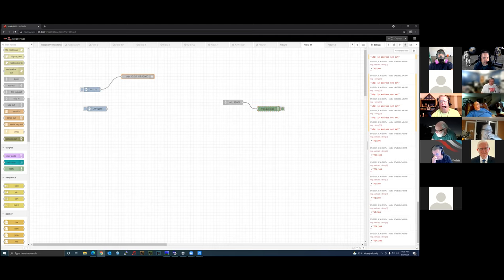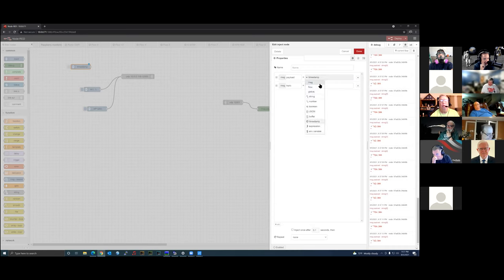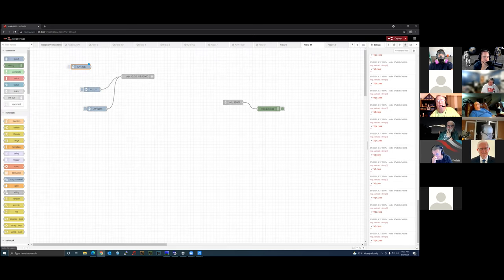PST Rotator, with the newer version, has a cool feature called target and azimuth. Target is your desired direction of the rotor and azimuth is the actual direction. But as you see, what's coming back is AZ colon 304 or 303. What we want to display, we don't want the AZ colon. So part of what we want to do now is wire up this other node just to be able to control it. I'll put one for 290 and another one to go to AP1305 semicolon, just so we can send it back and forth.